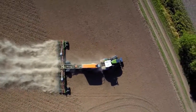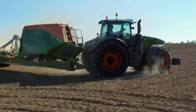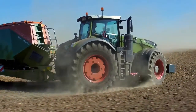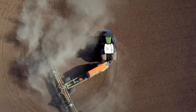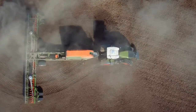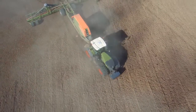At the headland, the first big difference of the Fendt VarioDrive becomes apparent. The front-wheel drive can pull the tractor into the curve while the tractor is cornering — a so-called pull-in turn effect. This effect alone reduces the turning circle in the field by 10%, or in other words, it saves about one and a half meters.